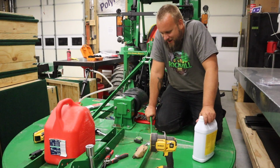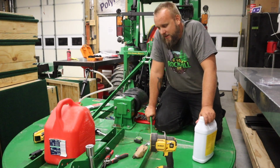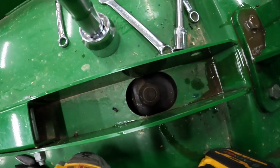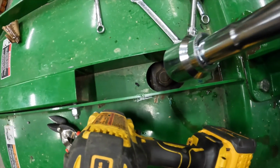And then I rewatched it the other day. I did sharpen the wrong side. So in addition to being beat to heck, these are sharpened wrong. But we'll take them off and see if they're salvageable. It's got a cutout here on the top that gives you access to take the nut loose without getting underneath the bush hog.